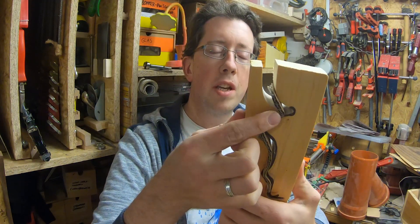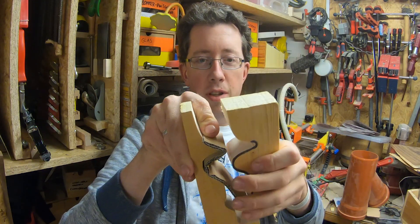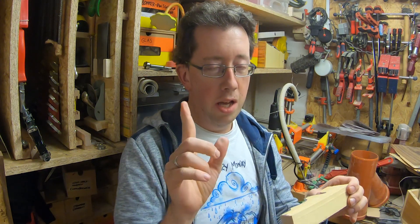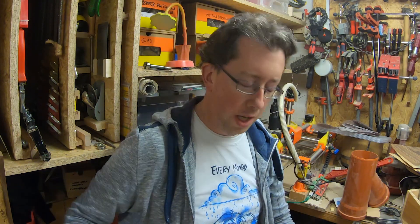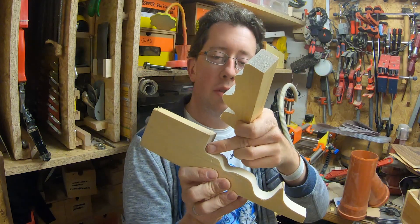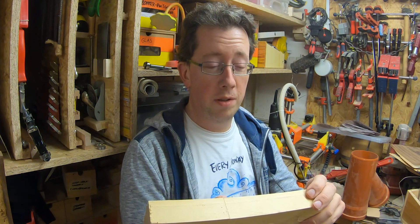If I put this in here, it pinches here. What that means is that you actually need a geometry on this side to account for the thickness on every surface. That's where this line comes in handy - that's about the thickness of the material I want to use, so I'll head over to the spindle sander and remove that much material. There's something else I want: I want this piece basically dented in a little so that if you put a pen in there it doesn't roll away. I'm going to use the material that I need to remove here, and instead of removing the whole thing, I'll work at an angle to get a divot here. Wish me luck.